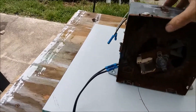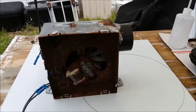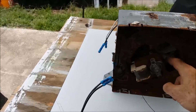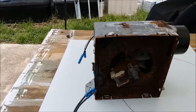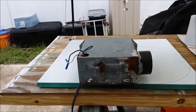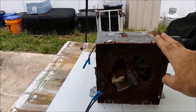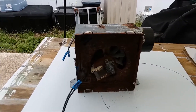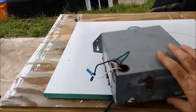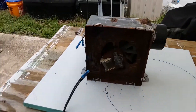My original idea was to get another one and mount it vertically on the back of the box so that condensation doesn't drip down from the top, which was a problem I was having. The problem is the cheap bearings they use in these things don't work unless it's mounted horizontally. I don't know of a brand of bathroom fans that doesn't use the same sort of bearing setup, so you can't mount it vertically — it just doesn't work.